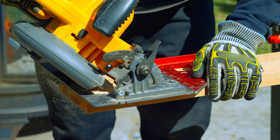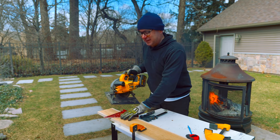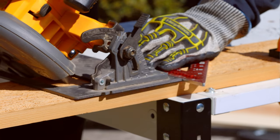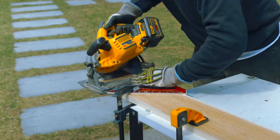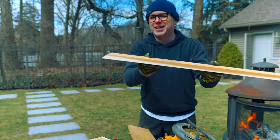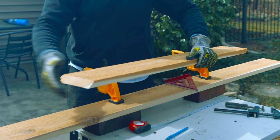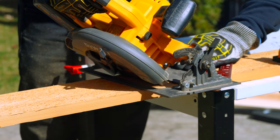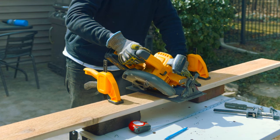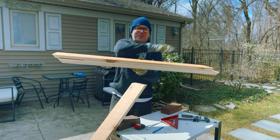Now we're going to head back outside into the cold to finish up this patio table. Got the circular saw set to 45 degrees — I've got two long sides to cut and two short sides. I'm using my square to guide the circular saw through the cut. I noticed on the first one, as I was trying to hold it down, it was sliding on me. So this next one, I'm going to clamp my square to the board so I can control the circular saw with both hands. I made a mistake — I've got an angle going the wrong way. You've got to keep your head in the game. Another lesson learned: if I have my board hanging over the side of the workbench and cut it off, it wants to split and break. I grabbed a couple of bricks to raise it up so both pieces are supported and it won't flip and break on me. Now I've got two boards equal length with no breaks and my angles going the right way.